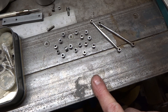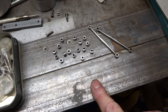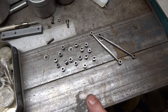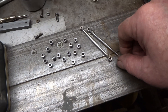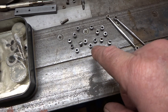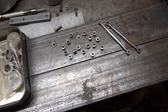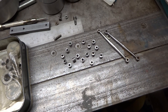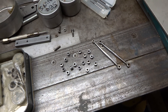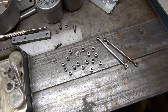Don't really know what to call these parts, but there you are then. One or two of them need trimming more accurately to length, but sixteen bearing ends or something for the shorter link rods which I've yet to make - drilled an eighth of an inch and cross drilled and tapped 10BA to take the rods that I've yet to make. I think that's enough boredom from one day - I'm going to go find something else to do. Have a bash at the rods tomorrow.